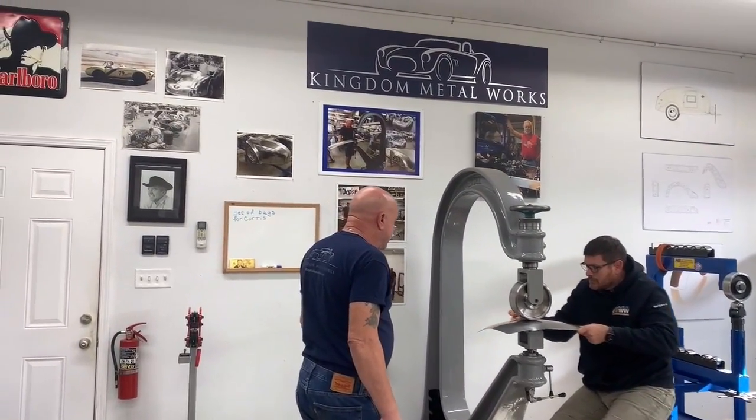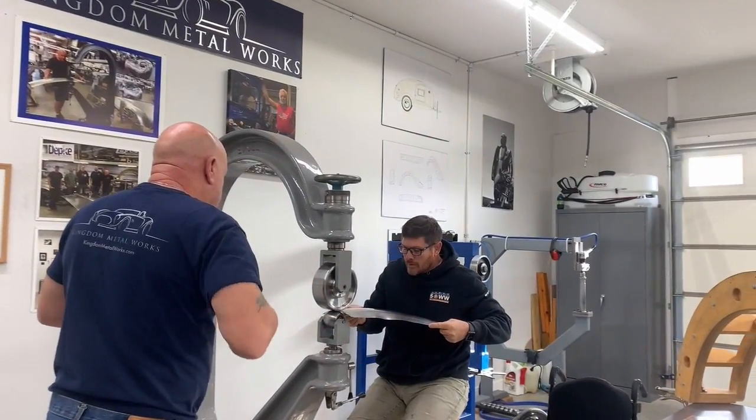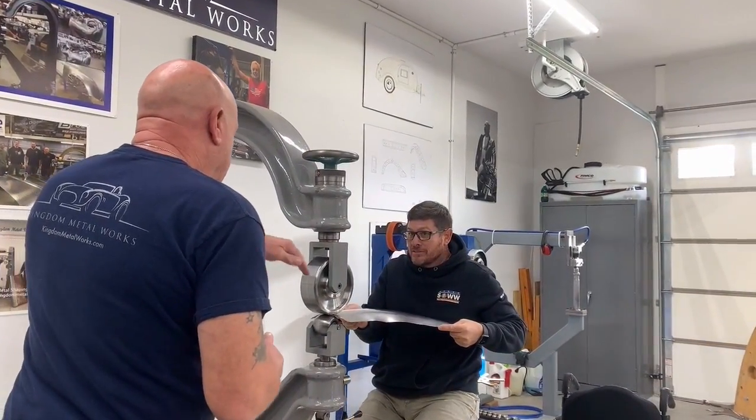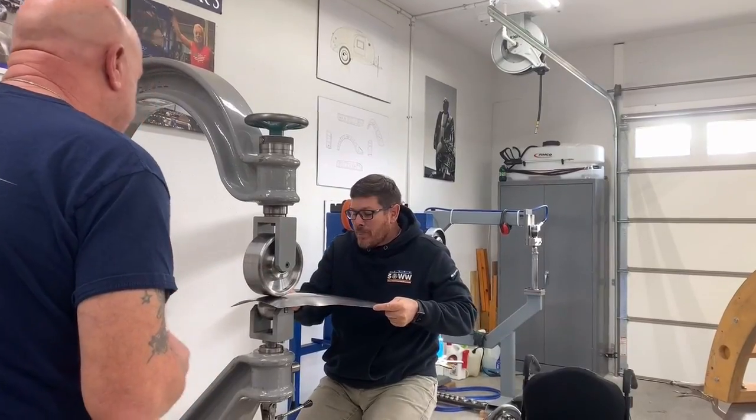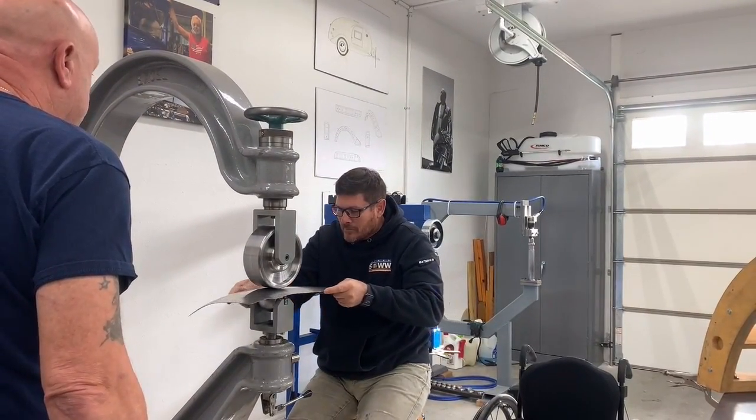Yeah, you've got a nice flow through, Jeff. You're keeping the pan nice and steady as you're throwing through the wheel. I'm watching my line, and then keeping evenness in the panel, but you're also getting your lines right on track, which is important.